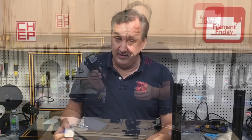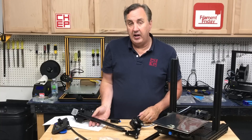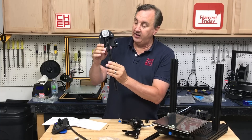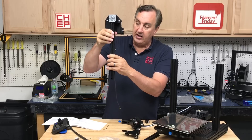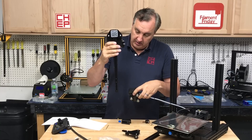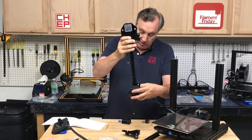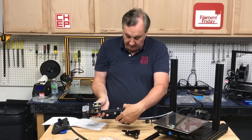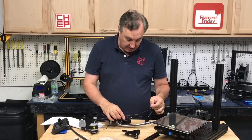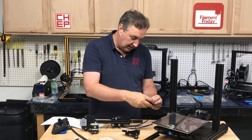Now we're ready to install the hot end. I'm going to go off the manual a little bit here — there is an idler adjuster, and I recommend taking it apart first. I'll show you why — it makes things a lot easier. I've got the belt hanging long on one side and short on the other. This is the top of the extruder so the nozzle points the other direction. I'm going to slide the belt through the wheels and then the wheels onto the aluminum extrusion. I'll hook the belt on one side of the bracket. Then for the other belt — this is where taking it apart is important — I can take the belt, slide it through the idler, let it dangle, bring the belt back through, and put it on the bracket.